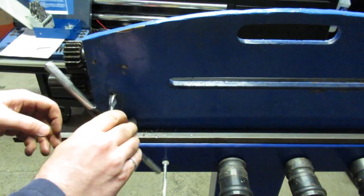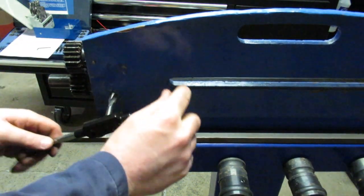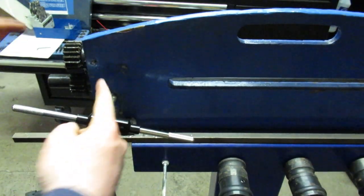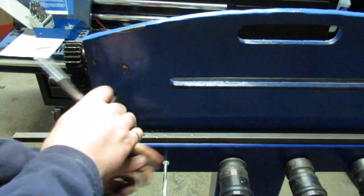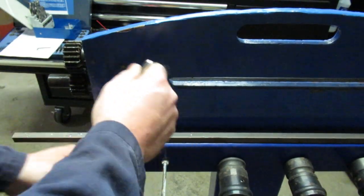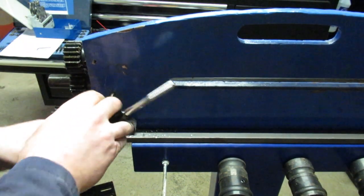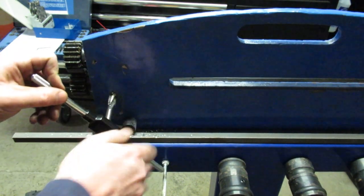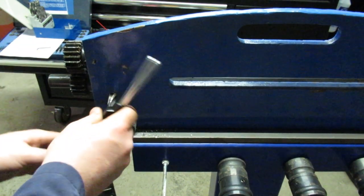So I was talking to millwrights, they told me that normally you use 3 different taps when you're doing a bottoming hole. You use an aggressive one to start, or not aggressive, but more of a taper on it. And you use another tap after that. And then you finish with the bottoming tap. So I'll recommend what they recommend. You should get 3 different taps to do this so that it goes a bit easier. Of course, it'll all be the same thread pitch.